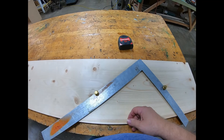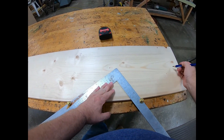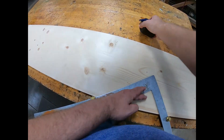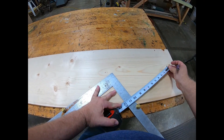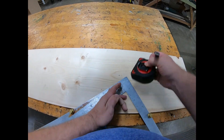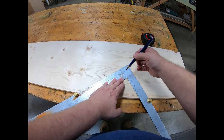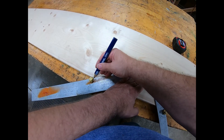Now you want to make sure that when you start your first step you leave enough room, because there's going to be one more up here. So I need at least ten and a half inches, which puts me somewhere over here. That leaves me enough room to make one more stringer at the top. So I've got ten and a half inches here.